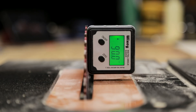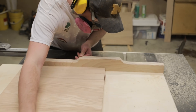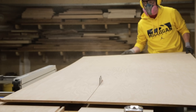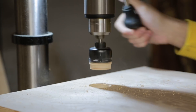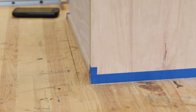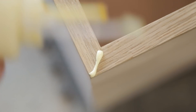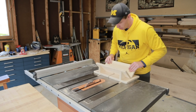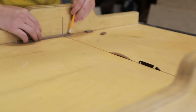With the panels ready, I can tilt my table saw blade to 45 degrees to cut the miters. Since the panels are cut to size already, I sneak up on the corner so as not to remove more than I have to. The last thing to do before assembling the carcass is to cut the back panel out of half-inch plywood. I also drilled a hole in the bottom of both back panels for a grommet for the cables. Because I edge banded beforehand, these came out pretty good. Miter joints aren't typically very strong, but with the back panel, these boxes are holding up well. Just in case, I decided to put some walnut splines in the corners for extra strength and a nice contrast.